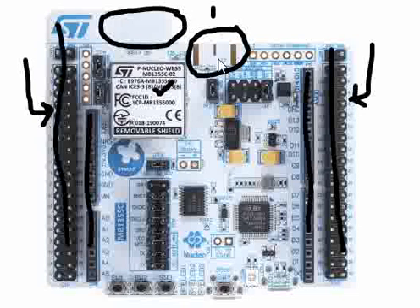One feature is the antenna and the RF section from this module so that you can transmit and receive data. The second thing is the buttons and the LEDs which are connected to the GPIOs of this module — we have three switches and three LEDs on this board. These can be used to test the GPIO features or the input/output functionality of the pins of the module.